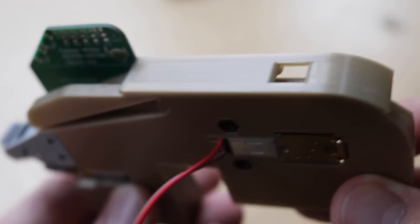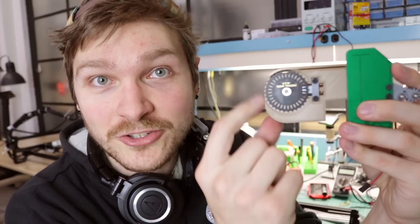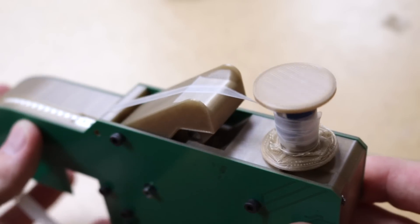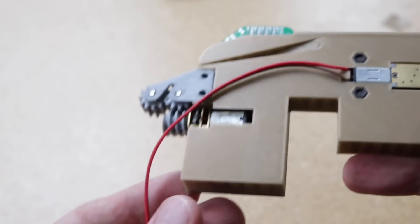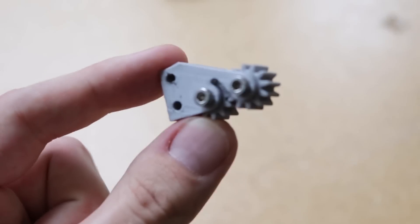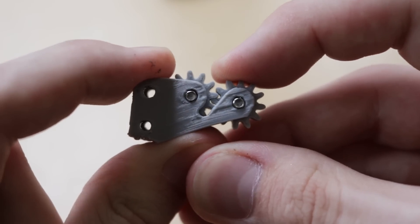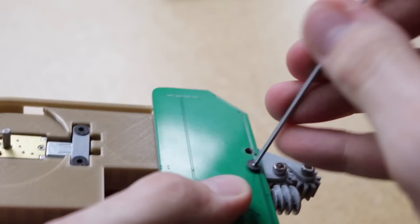I've got a pretty cool first pass. This design has the right angle N20 motor fit right in here and out of the gate it's a ton thinner — closer to about 18 millimeters now. I've also removed the huge film peeling spool from the last version. Instead, the film comes out of this top hole, wraps around the side of the feeder through a slot, and gets pinched between two gears. An N20 motor with a worm gear spins those gears to pinch and pull the film. The gears are mounted on a gray PETG print with a little preload to ensure good film grip, but with enough flexure to slip through once it hits the limit.